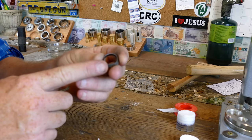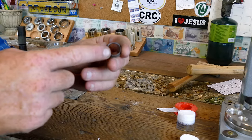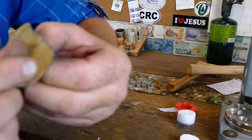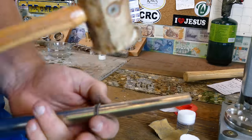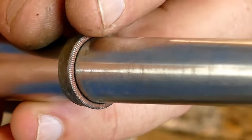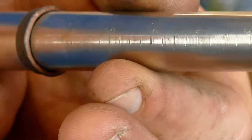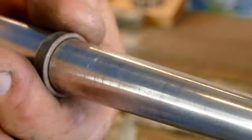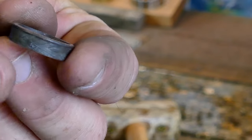It's also a good idea at this point to re-sand the cut edge so that way you know you're not going to get any cracks forming. If you see one, file it out with a file or sand it out with sandpaper. You can see at this point this ring is closed up really nicely around the mandrel — there's no weird spots sticking out — and that's key to getting a good-looking ring in the next step. So we're going to go ahead and pull this off the mandrel, re-anneal it again, and then we're going to start to size it.